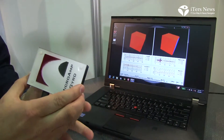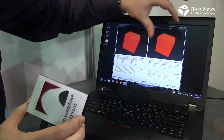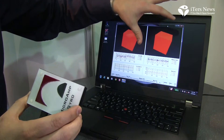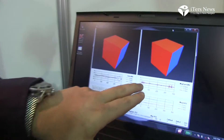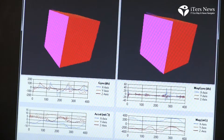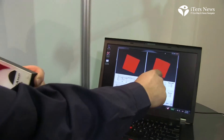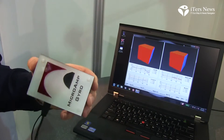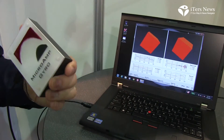What we have also done is with the same raw data coming out of the hardware package, we fuse together the magnetometer and the accelerometer to provide similar angular rates being calculated from the same hardware device. The hardware gyro has a specific output, and the calculated gyro has a similar output. As I rotate in space, the six-axis device of the magnetometer and the accelerometer behaves very similar to the nine-axis device and tracks closely.